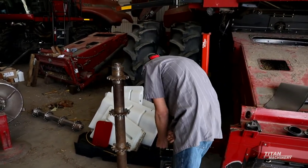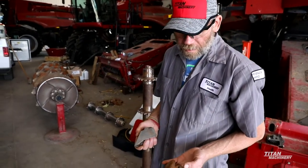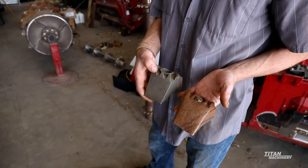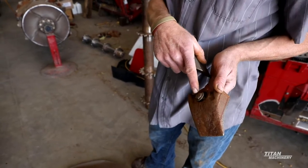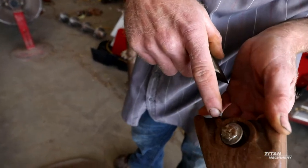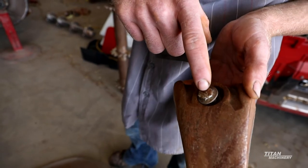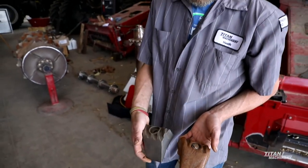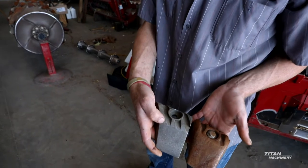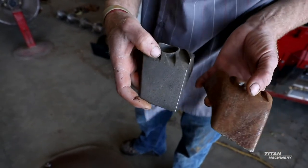The other thing to be looking at is your rasp bars. Here I've got a rasp bar that's worn out to where it needed to be replaced, and then I've got a new one to compare it with. When your bolt that holds your rasp bar on is half gone, you need to be replacing that rasp bar. Otherwise, if you keep letting it wear like this, when you go to replace it you actually end up trying to weld a nut to here to actually get the bolt out. You can see what a new one looks like in comparison and how much less threshing the worn one will do than your new one.